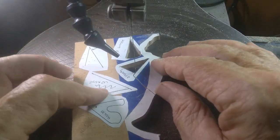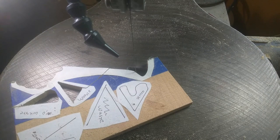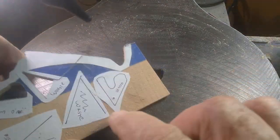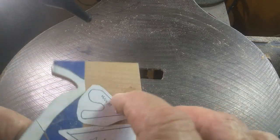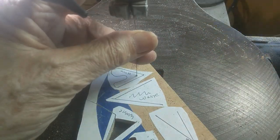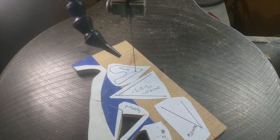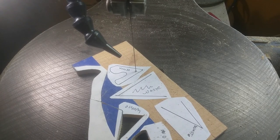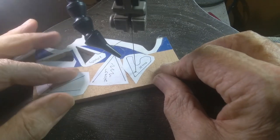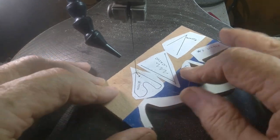When I have an internal cut with a sharp angle, I'll move the blade into that hole. I always like to drill my hole close to a point. I'll go right to that hole with my cut. My first cut I'm in the waste — that way it gives me room to operate in either direction.